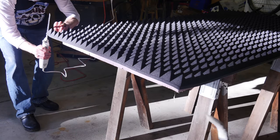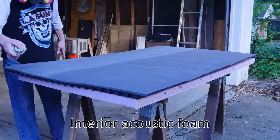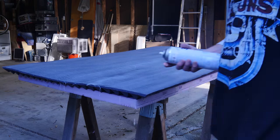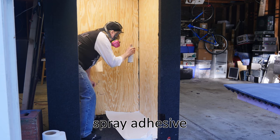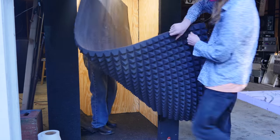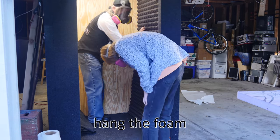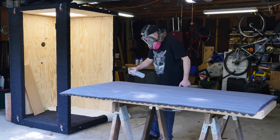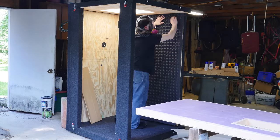It's finally time to do the interior acoustic foam. I have an electric carving knife — it works fantastic for cutting foam; I've probably cut more foam with it than turkeys. I'm using spray mount that they actually sold at the local foam supplier — I bought the acoustic foam locally. I'm wearing full-on mask and safety gear since I'm spraying this stuff even though I'm doing it outside. You do not want this stuff on the inside of your body. Both of us are wearing respirators, being safe. It grabs fantastic — no worries about it delaminating over time. The back panel hangs really well.